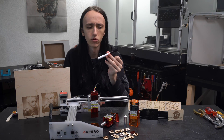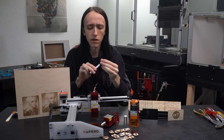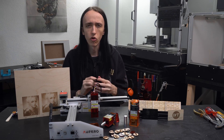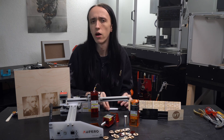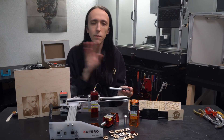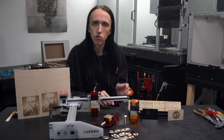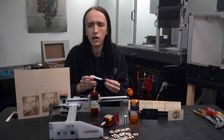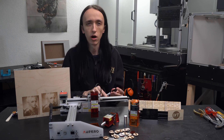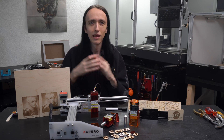I'm also somewhat embarrassed to say I finally figured out why all the laser manufacturers include those whiteboard black markers with their lasers. What you can do is just draw on transparent acrylic or any other material you usually could not engrave on, and then engrave on that. The results are not great but they are certainly visible. Make sure there is no dirt on the back, as otherwise you will also engrave the back since most of the light still goes straight through. Where you mark with the pen you get marking of the surface, and wiping off the pen afterwards reveals your engraved image. I would probably get a proper brand-name erasable pen if you want to use this technique more often, but it is something to consider for a one-off engrave on transparent acrylic.